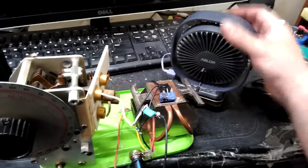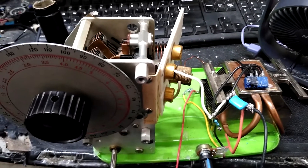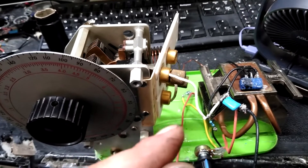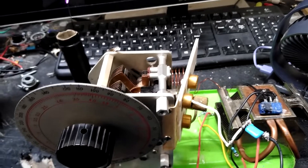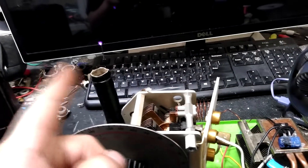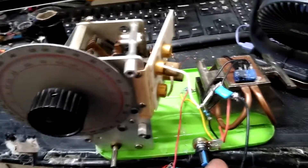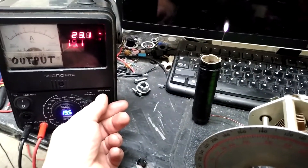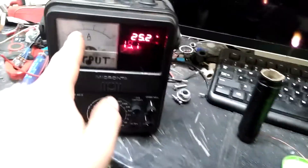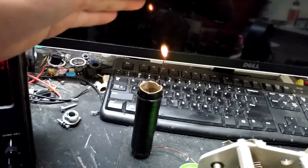I'm going to cut this fan on here so I can crank up the voltage. The way it's set now with this arrangement, the cap can pretty much stay where it's at. The pot can be changed around a little bit, but I've got it back down just barely to the point where it wants to oscillate at a higher voltage. If I back that down slightly right now, that flame will still be going, but once I reach about 24 volts it'll go out and I actually have to bias the gates a little bit more. So I'm going to crank the voltage up - you see about 25 volts, it's pulling close to two and a half amps, so that's over 50 watts with the cool little flame going.